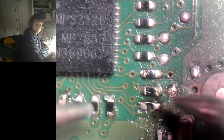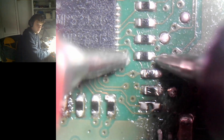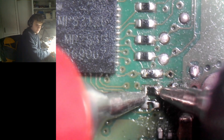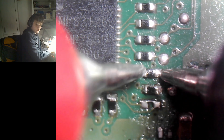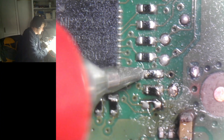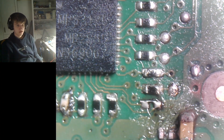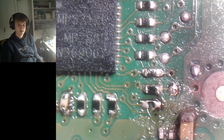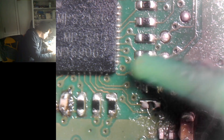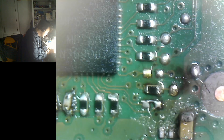I have found something here — in this big row of zero ohm resistors, all measuring zero ohm except this one, which has gone open circuit. I can't get a value on it in resistance mode: 4.1 million ohms, and this resistor is supposed to be a zero ohm resistor. It's actually one of the ones mentioned in the error code, so that's how I found it. When I tried to solder it, it just moved off its pad — so this resistor is definitely bad.